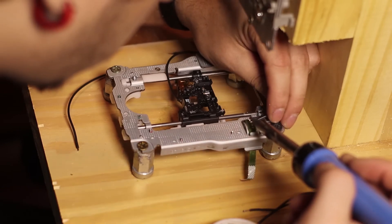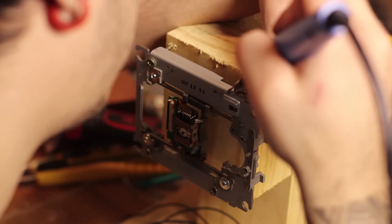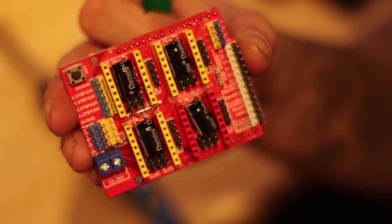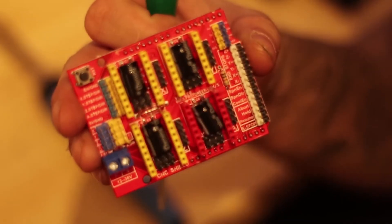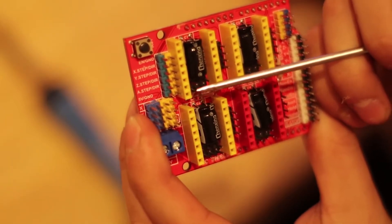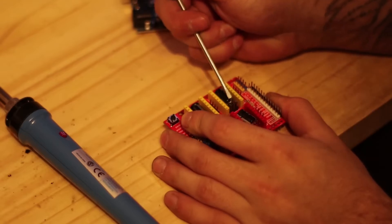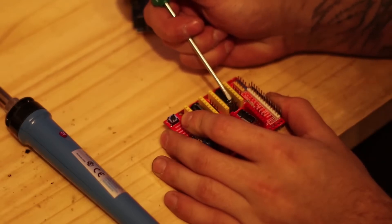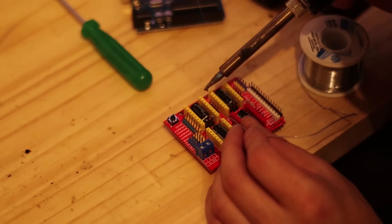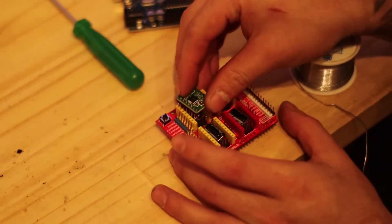The little motors on the side — the stepper motors that make the mechanism move — have four wires that we are going to have to solder. This is very easy because it already comes with a connector. We are going to use a CNC shield for Arduino Uno, which is the most basic and most common. We are going to bridge the pins shown in the video. You can use bridge connectors, but I just bent them and put a little solder — bridging with the one below the 6 with connectors.